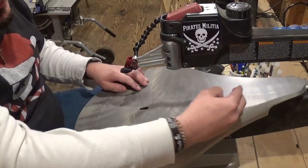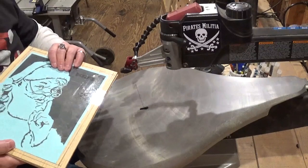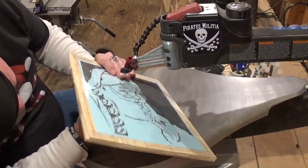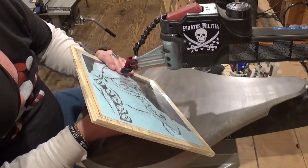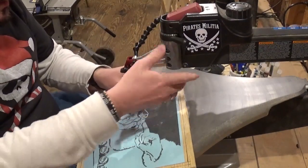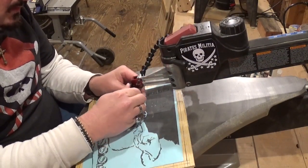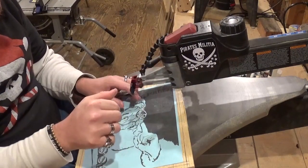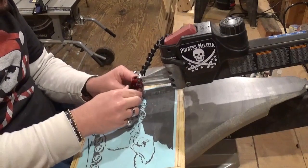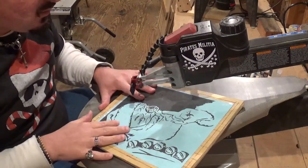If you have a smaller 16-inch scroll saw you can cut out even bigger portraits with spiral blades. We'll do one of the internal cuts here, then go into the basic time-lapse. Let's get the blade threaded through — it's a very thin and delicate blade. We'll put the tension on about a four. Sometimes spiral blades do stretch a little bit, so just take the tension off, quickly reset it, and you should be good to go for the rest of your cutting.